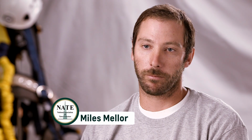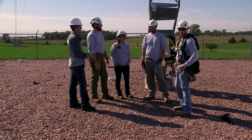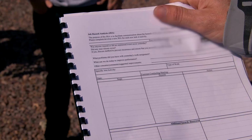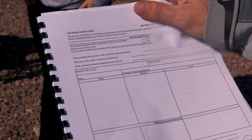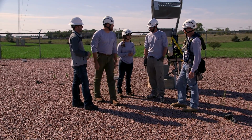Tower inspections are a vital part of maintaining and preventing equipment and tower failures. Full detailed inspections should be performed on an annual basis, while overview inspections should be performed whenever you're on site or climbing a structure. Detailed reports should record all information needed for your customer to accurately understand the condition of the structure and if anything is needed for repair on the structure.